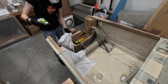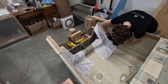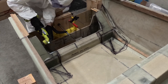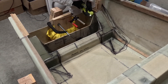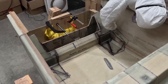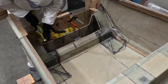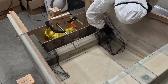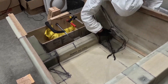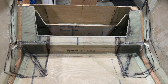After laying up both sides, I put peel ply over everything. Once this epoxy cured, I cleaned it up. I used my trusty oscillating multi-tool to remove the excess from the edges. Then I spent quite some time removing fiberglass over the electrical channel.